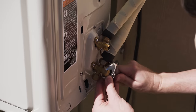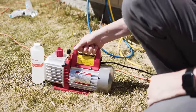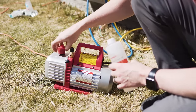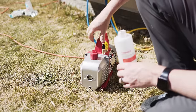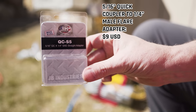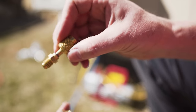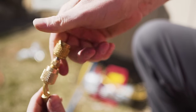Remove your remaining three caps for the service port and the valves. When you buy your mini split, it will either come with lines that are pre-evacuated or you may need to evacuate it yourself using a vacuum pump — and this step saves you hundreds of dollars by buying the non-pre-evacuated kind. This 5 CFM pump cost only $116. It comes with its own oil, so first fill it up between the min and max lines using the bubble indicator on the front. The next piece you need is the two-way manifold gauge set, which goes for about $60 on Amazon. You'll also need a 5/16 quick coupler to quarter inch male flare adapter — about $9 for a two-pack online or at local HVAC stores. This adapter screws into the blue pipe from the manifold gauge set and then into the service port on the low pressure line.